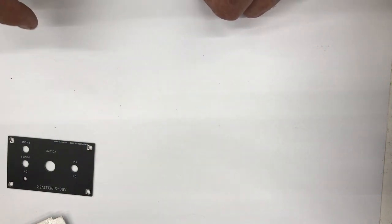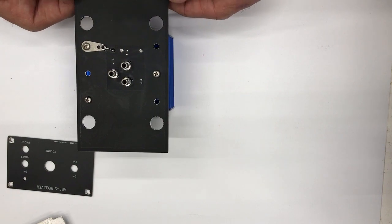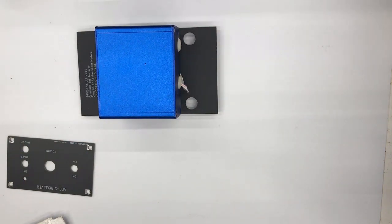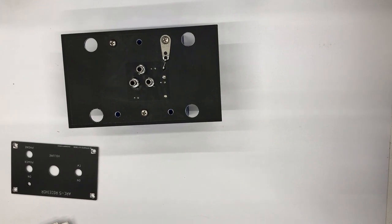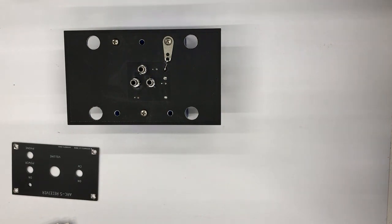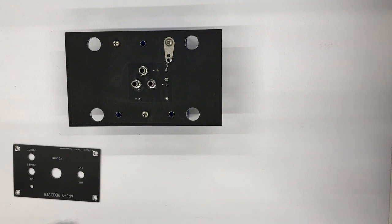And then lastly, an idea of what the inverter looks like. What I ended up doing is building a circuit board that essentially form-fits over the dynamotor connections. A lot of people have soldered directly to those miniature banana jacks where the original dynamotor was, but with a little solder wick you can pull those back out and the form factor on these contacts will fit right down on it. Many times on a 75-year-old radio the anti-vibration studs that held the dynamotor have deteriorated. I've 3D-printed some replacement posts if you need them. In the case of this AM radio, those studs are still in good shape, so I didn't have to replace them.